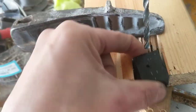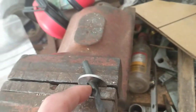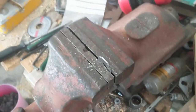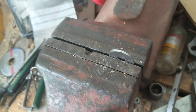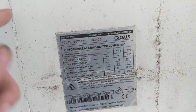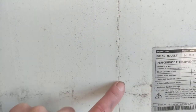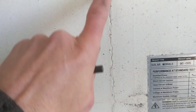These panels are five centimeters thick, so I made this jig to simply put the rubber in quickly and make the holes. Here for the edge it's just a seven millimeter bit — fasten it, then simply take a hammer to make the side washers. These are only 220 watt, probably 10 to 15 years old. They are not fully waterproof, which is why they were so cheap, but that's not a problem for my small system.